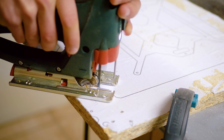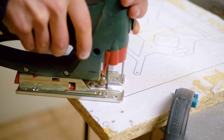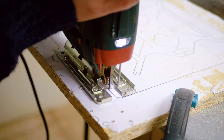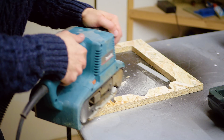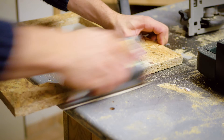For the jigsaw, I can definitely recommend these thinner, curved blades for the smaller details of the frame — it just makes getting in and out of the corners so much easier. To get the rest of the templates off, I gave it a quick pass with the belt sander and then went back and cleaned up the details with a file and rounded over the edges with some sandpaper.